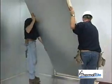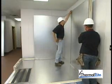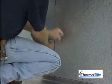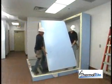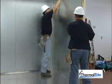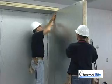Repeat the operation to extend the wall toward the second corner. Check the blueprint to get the correct wall panels. Check to be sure each wall panel is tight against the previous one. Once the second corner is complete, construct the next 2 walls, the ones that face each other, at the same time. Add a panel to one, and then the other, and so on.